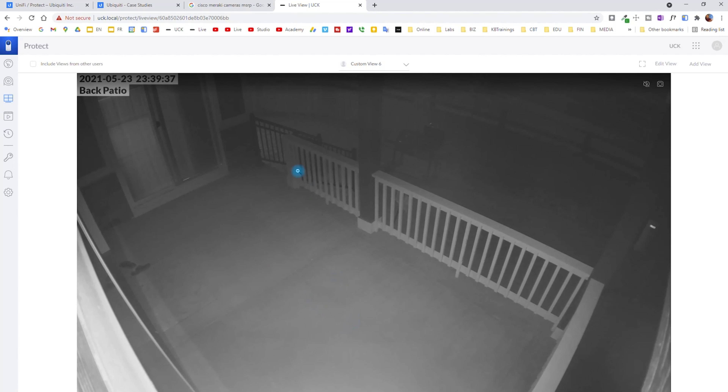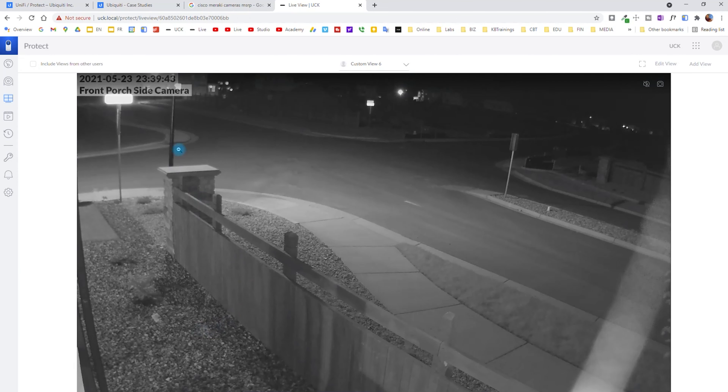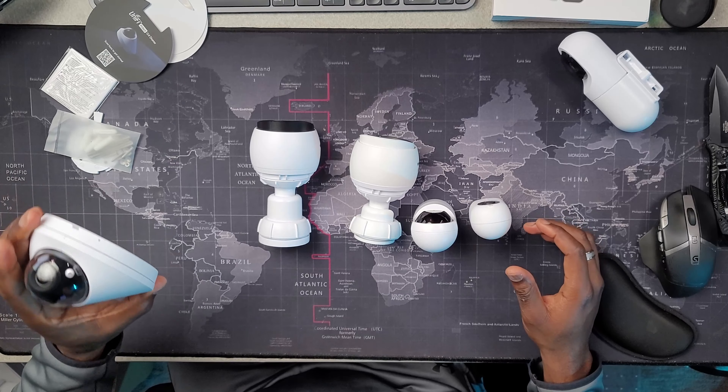What I don't like about it is the IR at night. Sometimes you get some noise and some spill — like on my back patio, you can clearly see that the infrared is really, really noticeable right here, and you don't see much when you go far. This is not something you have with the UniFi Bullet — with a bullet you have a clear image pretty much everywhere. But that's not preventing this from being my favorite camera that I can recommend to everybody.